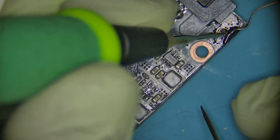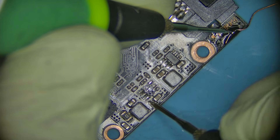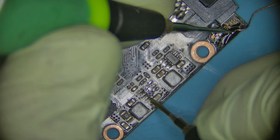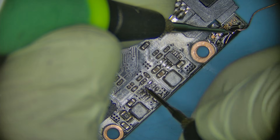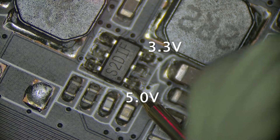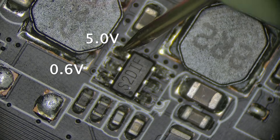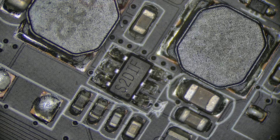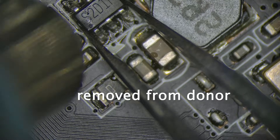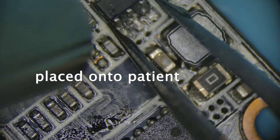Checked the same line — the line was open, so we were ready to go. Here you see me probing the values of what sort of voltages we should be having on the pads with the component removed, and that served as my guideline to locate the compatible unit. After I found one, I simply took it off because the readings were all the same on the output as well and the chip worked out great. Actually, these components are quite swappable — there are different variations of them. As I was troubleshooting back and forth, I used some of the good working devices and had them swapped out just to make sure they're not causing any trouble.